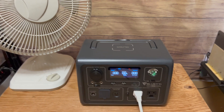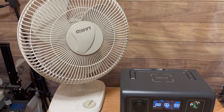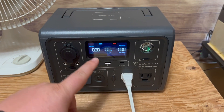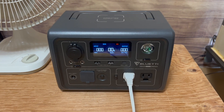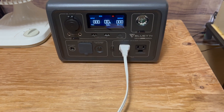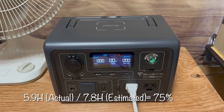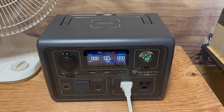I'm a little surprised. This is a very real-world power draw test — running a fan of only 30 watts constantly, and it's just shy of 6 hours. When I started the test, the estimated run time was 7.8 hours. We're about 1.8 to 1.9 hours off from what it actually ran. 5.9 divided by 7.8 is approximately 0.75, so the power station was able to run 75% of what the estimated run time suggested.